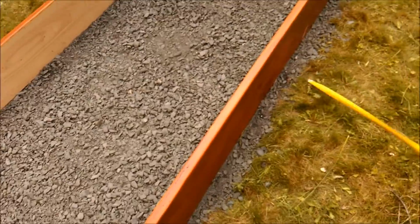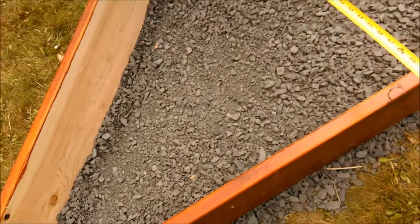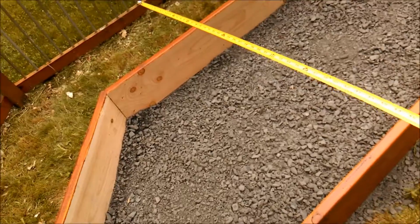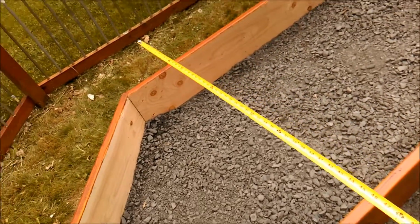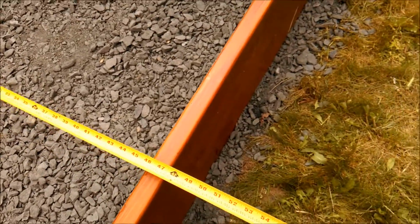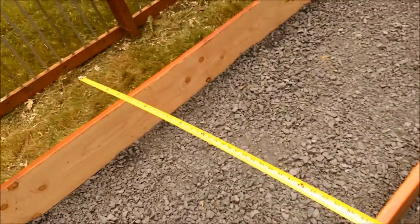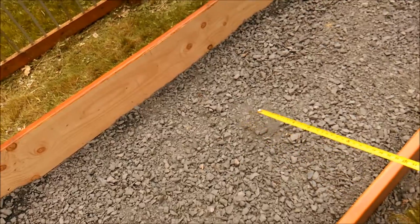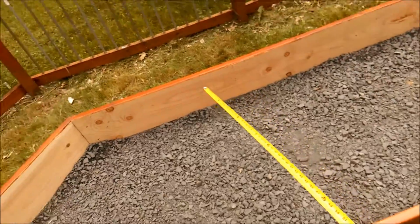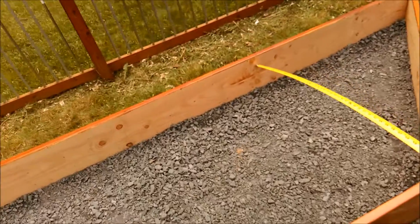So what I'm gonna do, I bought some cheap 2x3s untreated, right? These are 1.5 inches thick each way, each side here. That's 3 inches total of wood, which means that I need, I think I'll do two 46-inch pieces of wood here, just to tie these together, edge to edge, just to make sure that when it's filled with soil, these long sides don't bow out. And so I'll put them approximately, I don't know, a third and a third of the way down.